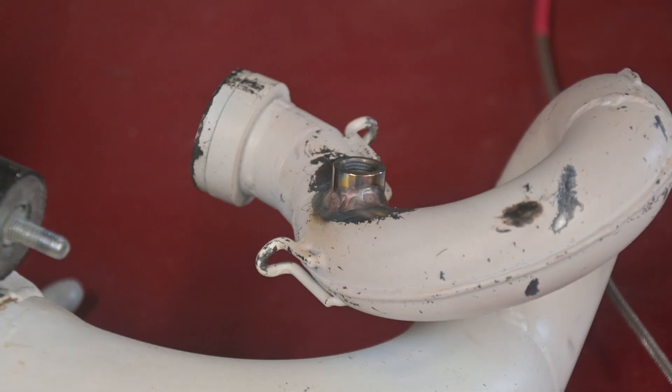I got the fitting welded in there now. Since this pipe is not stainless I did not bother to back purge it with argon, although I was tempted just to blow the oil smoke away from the back side of the weld, but decided against it — more hassle than it is worth. The next and probably most important step is to clean the chips out of the pipe so they do not end up in the piston or cylinder walls. I will take care of that and then get ready to give her a live fire.